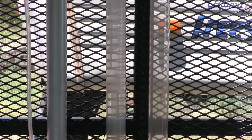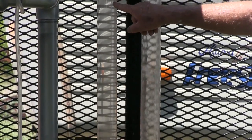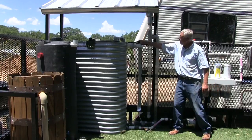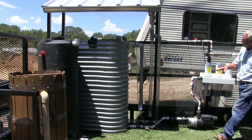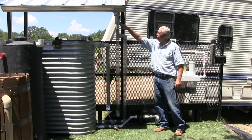We see it's first filling up the first flush. This water is then diverted — the goal is to have this drain all the water out within 24 hours. Then once that water is diverted, it goes into my line, running up and into that storage tank. Research has shown that mixing only takes place in the top one foot, and the rest of the water is diverted so it's not contaminating the collection tank supply. We can see it's also filling up on the other side and water is flowing into the storage tank. We can watch the bubbles to see water moving into that collection tank from the gutter.